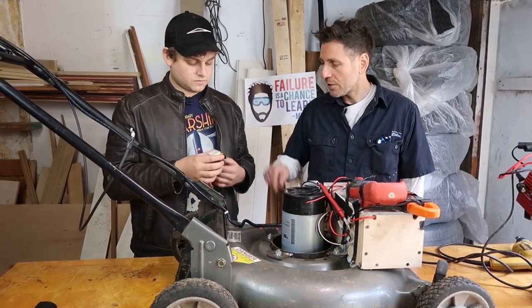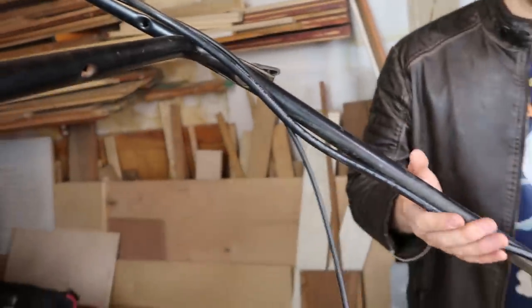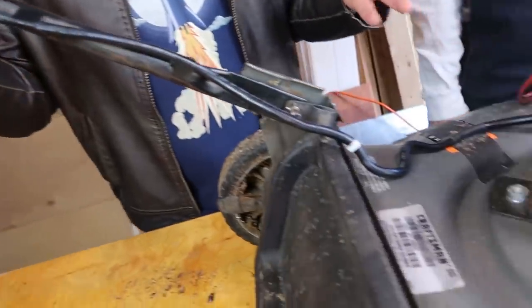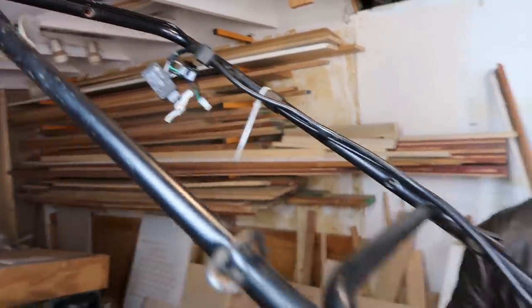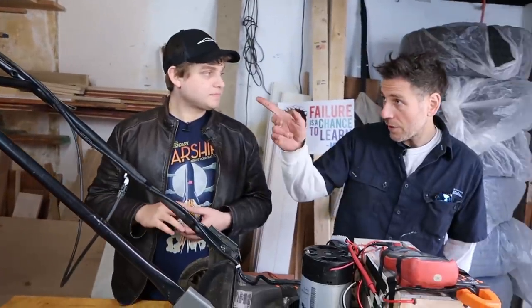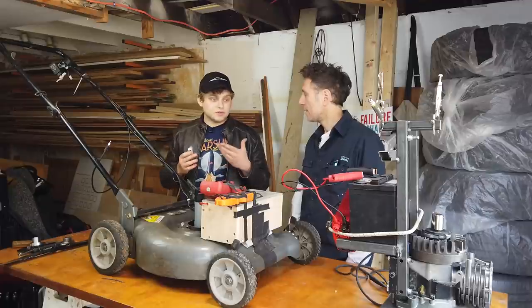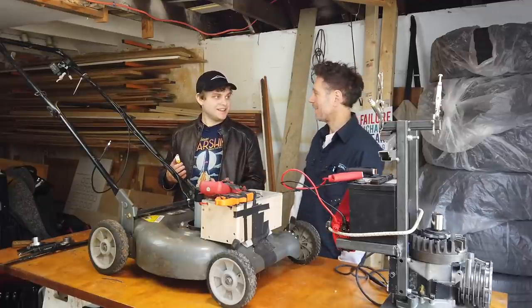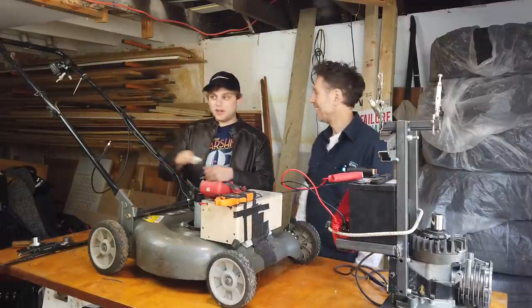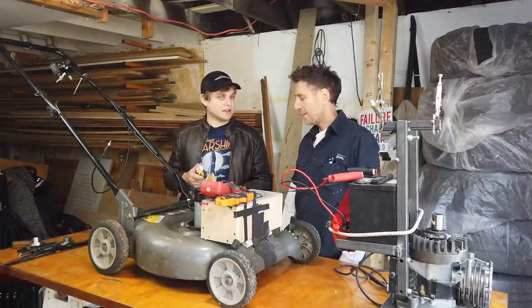You just research — type in some numbers, there's a lot of stuff on the internet, you could just get it on eBay. We used a cable harness from a working electric mower, and it already had the switch up here that does the exact same thing. I took the numbers off that switch and bought a spare. Worst case you could use a light switch, but we don't recommend it because you'd shut off the mower and it would keep spinning with the inertia of the blade — that's dangerous.